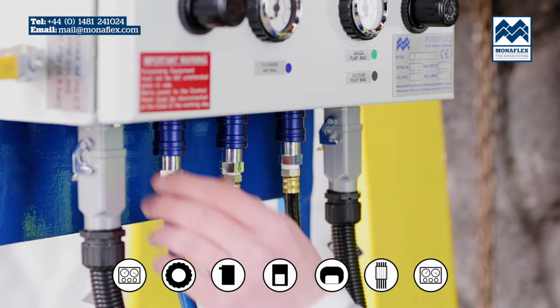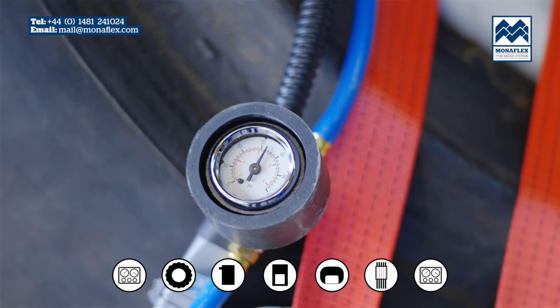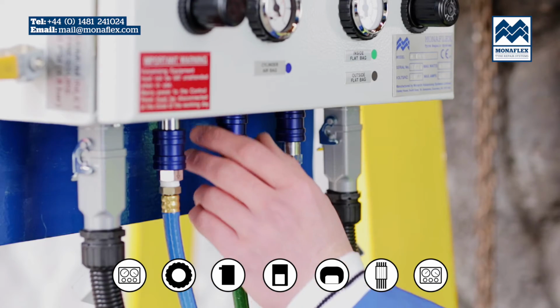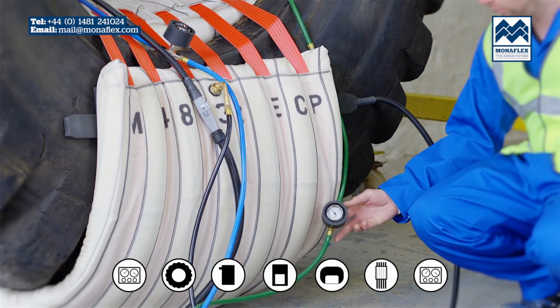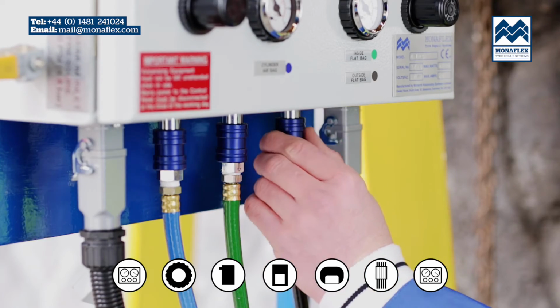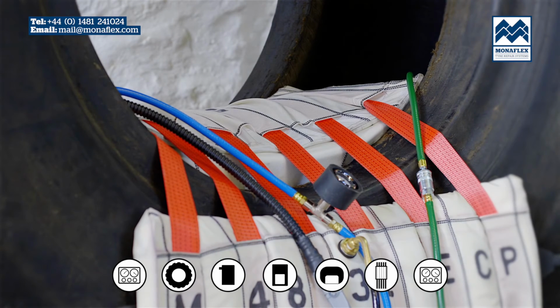Commence inflation of the cylinder airbag by pulling the panel slide valve down that's connected to the blue air line. When the pressure gauge on the blue air line shows approximately 20 psi, commence inflation of the inside flat airbag by pulling the slide valve down on the green air line. Let both continue inflating until almost full pressure, at around 25 psi, at which point open up the slide valve on the external curing pack air line, and all 3 airbags will reach the desired operating pressure.